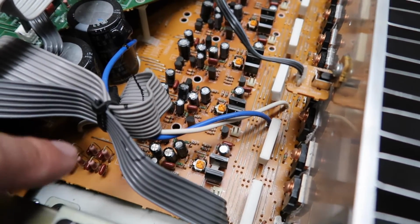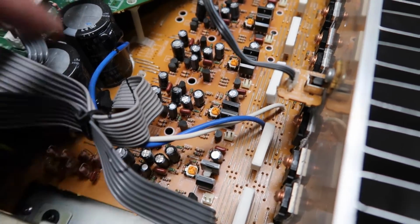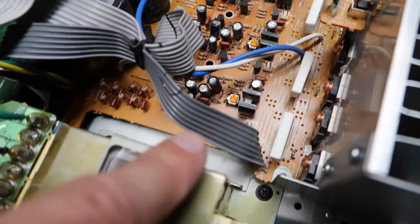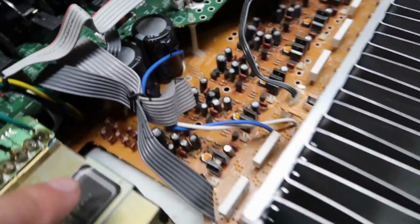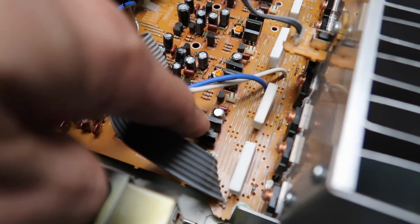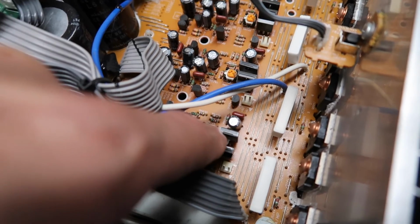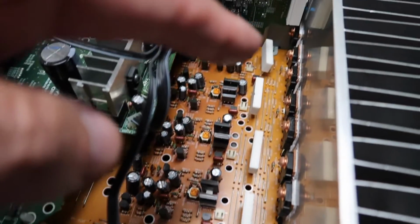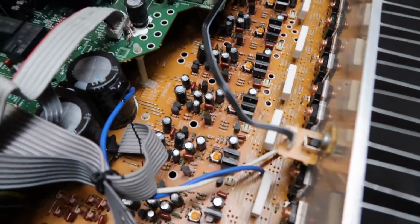This has the type of board construction I've seen in this type of unit. It has a one-sided PC board with a lot of these jumper wires, which kind of makes it a poor man's 2-sided board. These larger transistors are just air-cooled without heat sinks, so they're probably not running a whole lot of power, but something is probably needed to boost the signal into the power transistors.